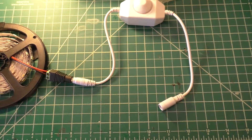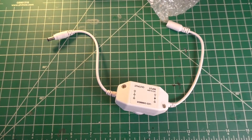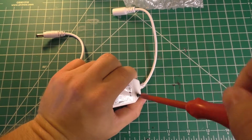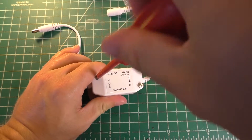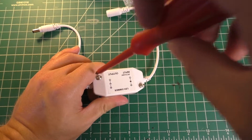Let's go ahead and pull this apart and see what's inside. If I had to guess, it's probably something really simple — either some kind of purpose-built circuit or a blob IC, or maybe even just a 555 timer. I'm guessing it's not a microcontroller because if it was a microcontroller, I would expect it to be able to hit 100% duty cycle without any issues.